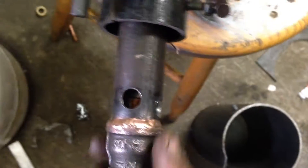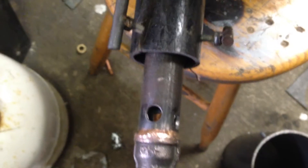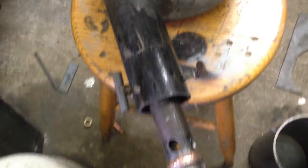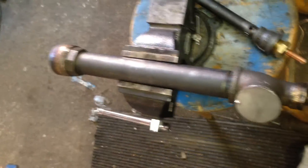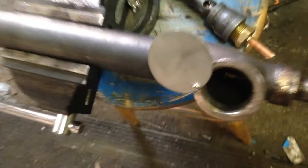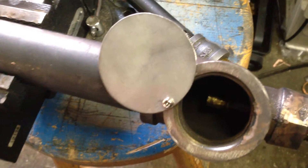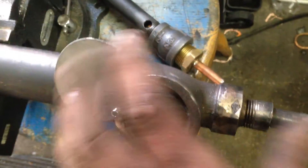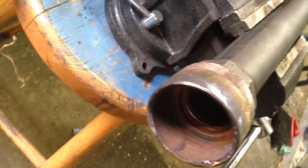Over the last few days I've been working on burners. I've been making my own burners out of gas pipe. This little guy here — well, it's not really little — is probably pushing out about 350,000 BTUs. It's a pretty big burner. This one though is a whole hell of a lot bigger. I got an air vent here. You can see the orifice in there; I made the orifice out of a piece of solid brass pipe, threaded one end, drilled a hole through the end of it. I ran some piping, made it all adjustable to start with, and played around until I got some nice flames coming out the end.